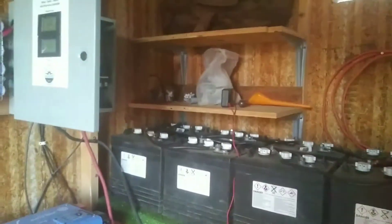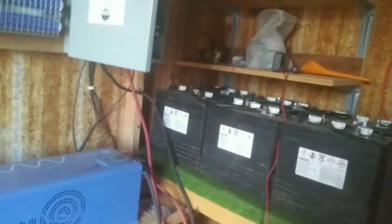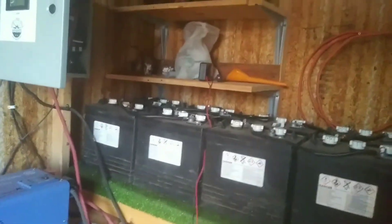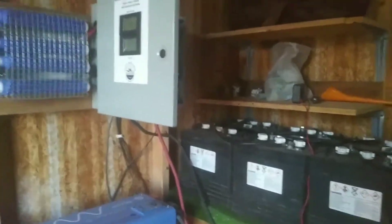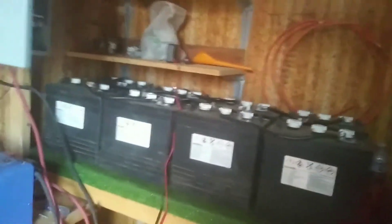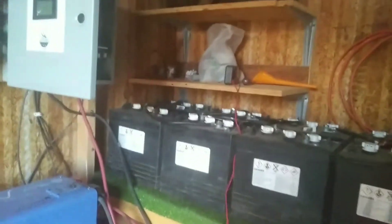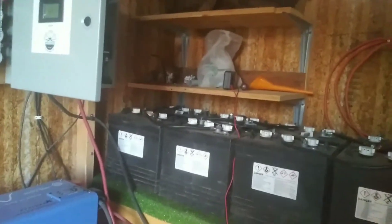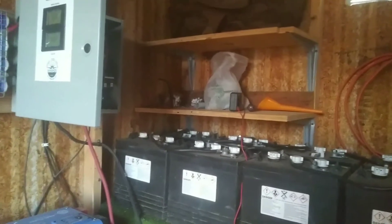What you have to do is calculate from your 1800 watts — your watts is pretty standard. From there you just divide by your system voltage. I'm running at 24 volts, so that means I get 75 amps of charge to my battery. That's a good starting point. When you think about how things run — your air conditioner, refrigerator, lights — you can convert everything to amps and that standardizes it for you.